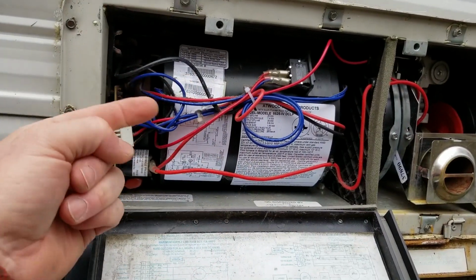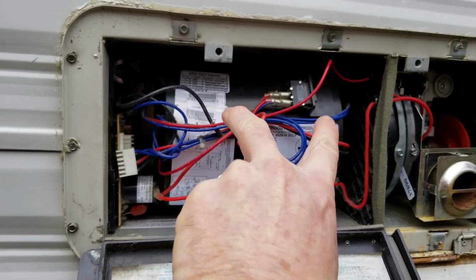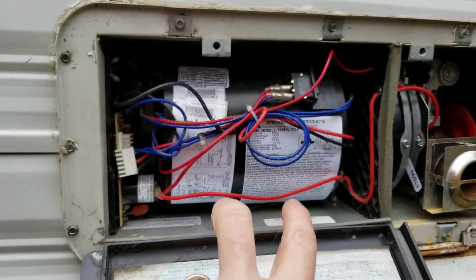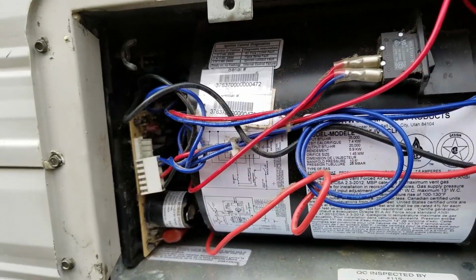We'll take this off to show you what the sail switch looks like. There's going to be two screws in the bottom, two screws on the top is typically what we have, and maybe a couple of tie wraps to snip off. We'll pull this off and show you the sail switch. I want to inspect it anyway. Then I'll put two new screws on top, two new screws on the bottom, and we'll have a happy camper. While I'm taking this apart, I'll show you this.